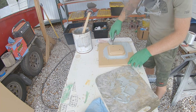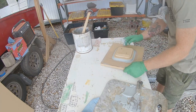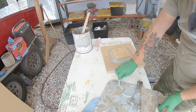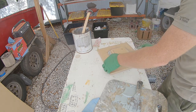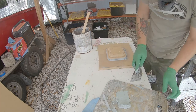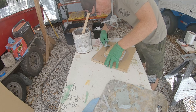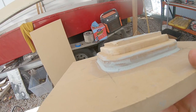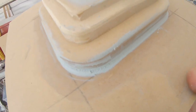I use my metal spatula to clean up all the excess — I try to clean up as much as I can so I don't have to sand it off later. I drag the hot glue piece around the filler and the rounded edge makes a nice 3/8-inch radius in the corner, then I clean it up more with the spatula, removing lumps and ridges so I have less sanding after it cures. You can see a nice clean radius, and once this cures I'll come back, sand it, and add any filler if needed.